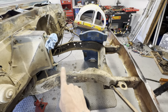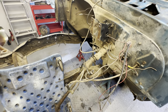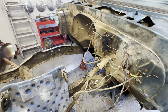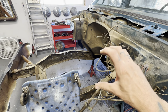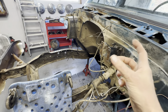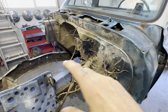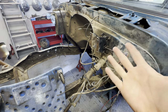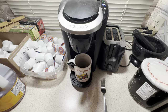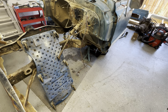I'm not liking the whole Z-ing in the front where all the weight is bouncing on that weld, even though I trust the welds. People don't pay enough attention to the metal you're welding to being the same thickness. Like, you weld a quarter-inch tab onto the frame but the frame is only just over an eighth of an inch, and if there's any vibration on that tab at all, it's going like a coat hanger.